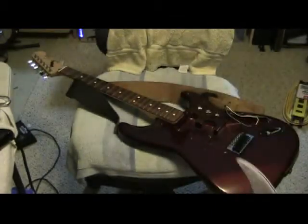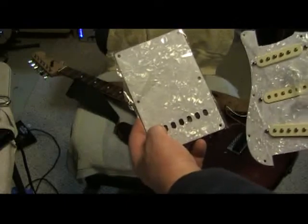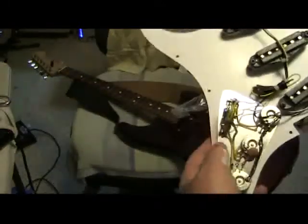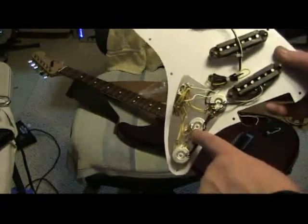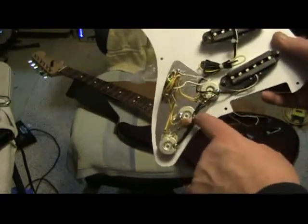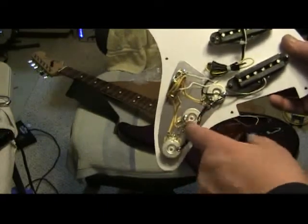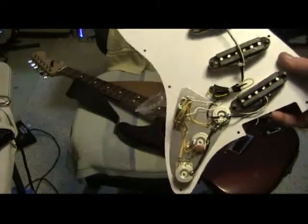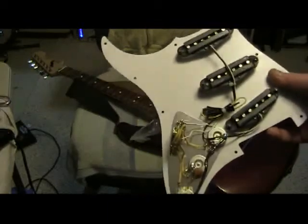It's got the back plate for it, the same thing, instead of just being a black one, which was on there originally. But what I was trying to do is I went back in and bought new CTS pots, and this is a capacitor for the Blackmore one, a 0.05 microfarad 100 volt 20% capacitor. If you're not sure what that is, anyway, I'll be scanning over to the schematic on it that has a breakdown for this.